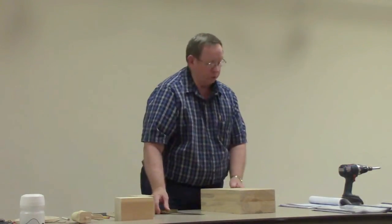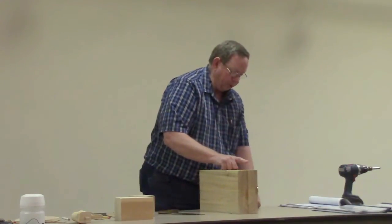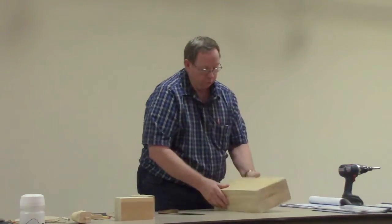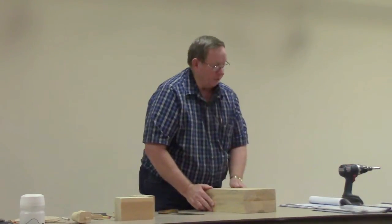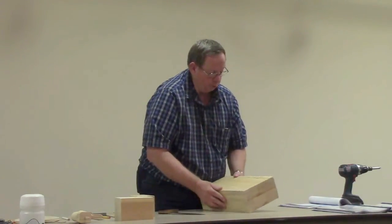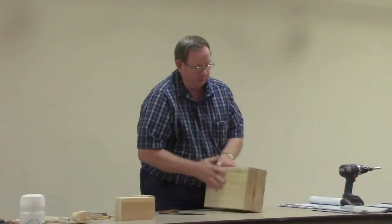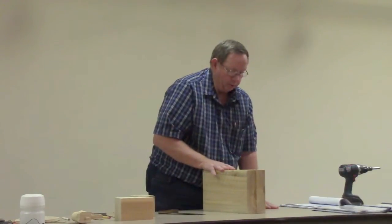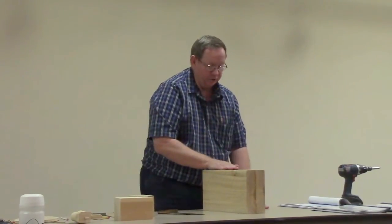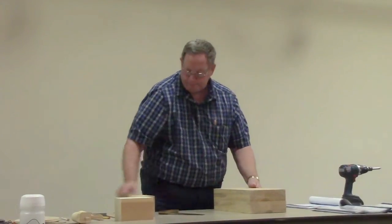The other thing is, if you're a little bit out of plumb, out of square, and you're sawing about 10 or 11 inches thick on your bandsaw, it's going to compound that angle a little bit. So as you prep your block, I usually like to get one side that can be a little bit rough to put my pattern on, but the side that I'm going to run through the saw, you can see one side of the block I got a lot smoother. I put that on the table bed of the saw so she's not rocking. The other side, if there's a little roughness on it, I really don't care. With that being said, I kind of chase my lines around the block.